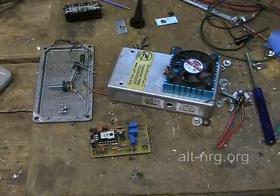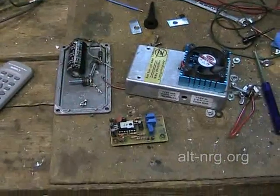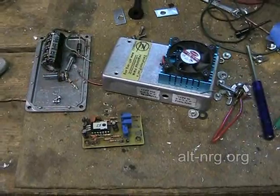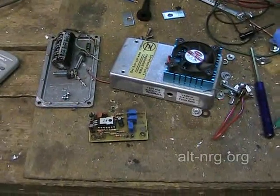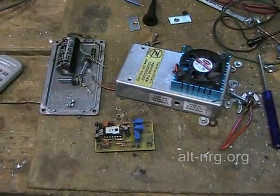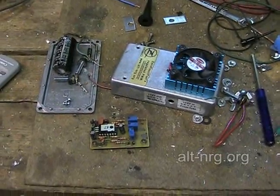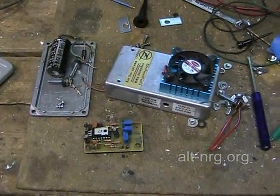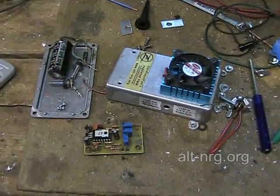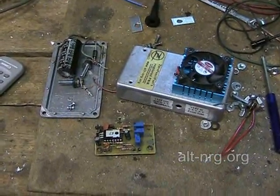So, that's it for now. Once again folks, this is what not to do with one of my pulse width modulators. Do not feed it into a dead short because it will still try to regulate at whatever amperage you have it set at, but the peak impulse current will be off the map and components will start to fail. What caused this unit to fail is a parallel plate cell design that was recharged with electrolyte that was much too strong, and it appeared to the pulse width modulator as a virtual dead short.